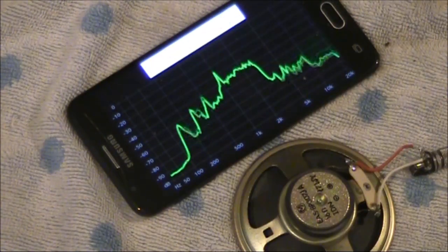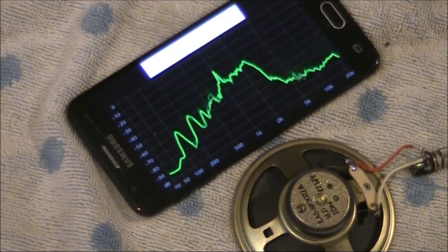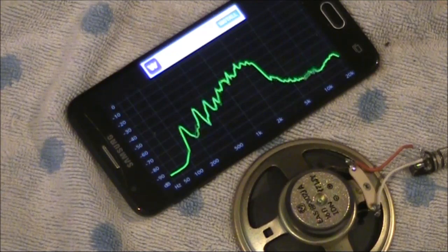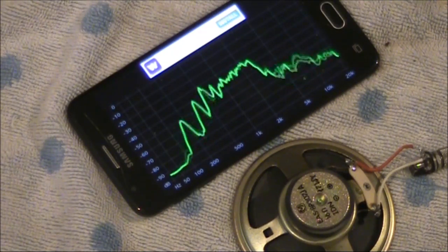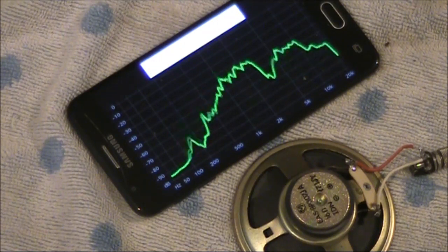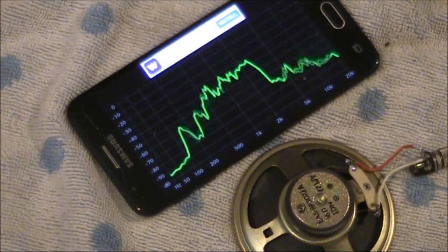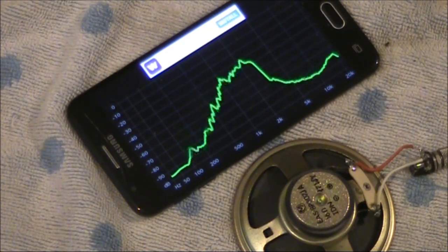That's a quick little thing you can do. A real handmade audio filter for CW. If you want to try Morse contacts but have problems with interference from other stations on nearby frequencies and don't have a CW filter, then this is a handy way of fixing the problem, especially if you've got an electrolytic capacitor to put in parallel with the speaker for further top cut.